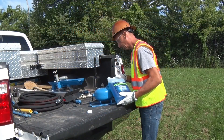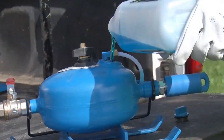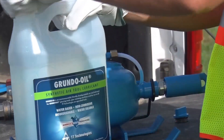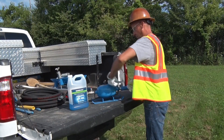Fill the lubricator with Grundo Oil. Grundo Oil is a high-quality pneumatic lubricant, essential for optimum piercing tool performance, and supplied to the tool through the in-line lubricator. Grundo Oil prevents water vapor from freezing inside the tool and is completely safe, biodegradable, and has no harmful effect on rubber hoses.